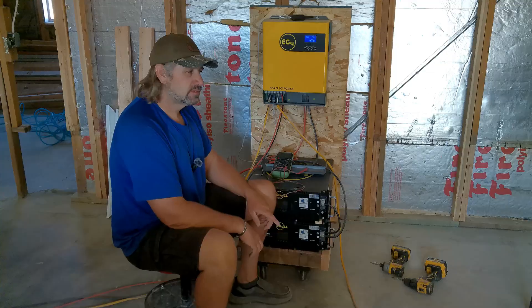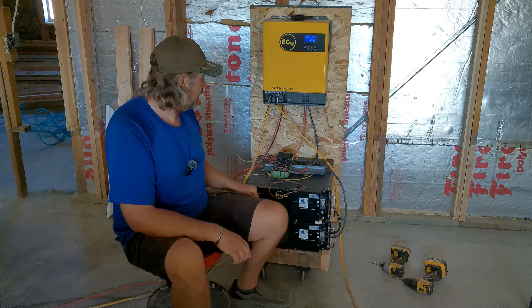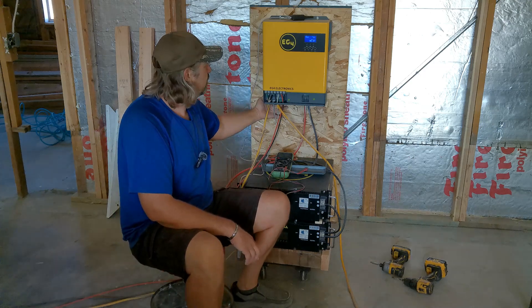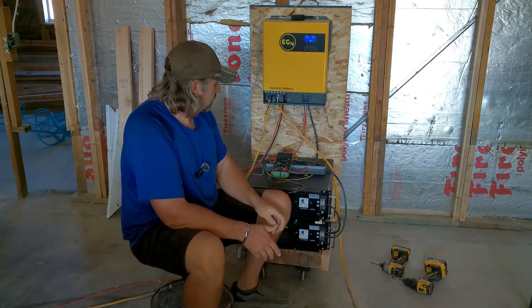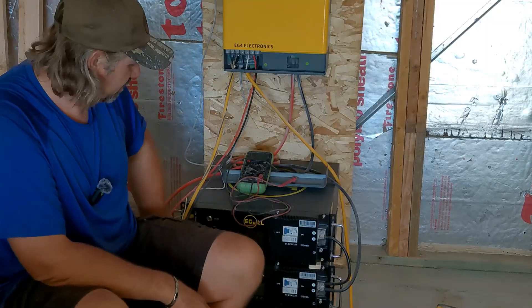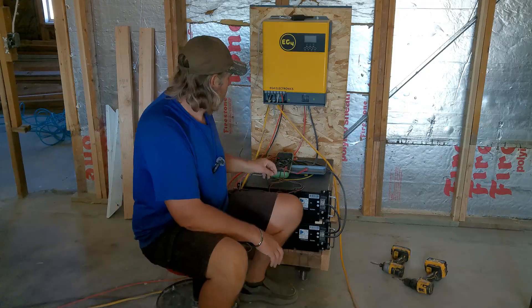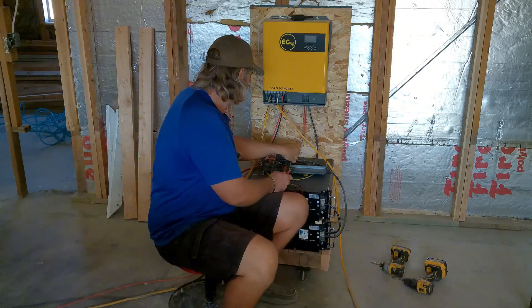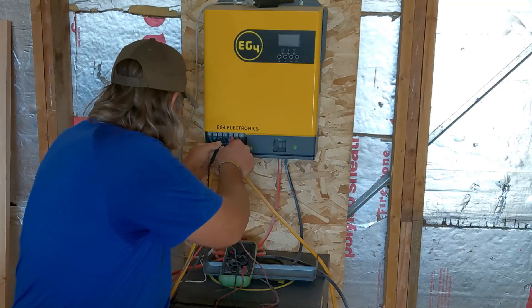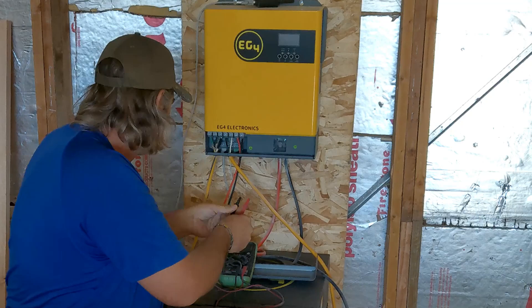Let's see how this thing's going to fit. Time to take this all down. So we're going to cut the power, turn off the inverter, turn off the batteries. Pretty nice having breakers on the batteries. We'll turn off the BMS too, so that's all shut down. We'll test — testing for AC power. Of course it'd be off, but nothing there.